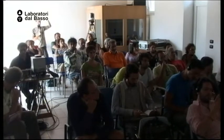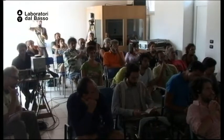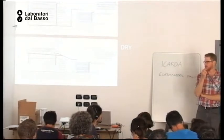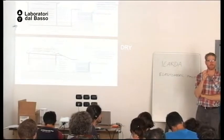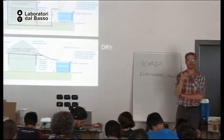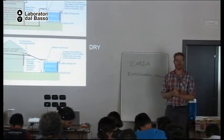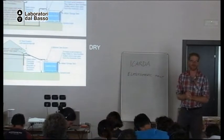The water is slower in the communicating system. Yes, it has to be. And it's good to be at least, what would 6 inches be? 3, 4, at least 150 millimeters lower would be good, but if the cistern is close enough, you could cheat, but I would want at minimum a 150 millimeter difference.